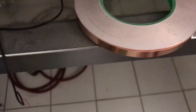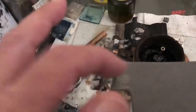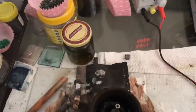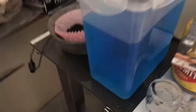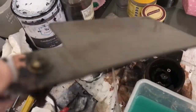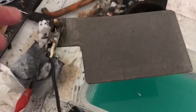So, plastic with some copper tape. You have to tape it and then acetone the copper tape, because it has a resin or a wax over it and the ink doesn't quite stick to it properly. So once you do that, it sticks. Then I plated it with copper in copper sulfate. Then this is a nickel plating on both sides. That's 3 hours, an hour and a half each side. So I hope you enjoy this video, and thanks for watching, and stay tuned for this battery.